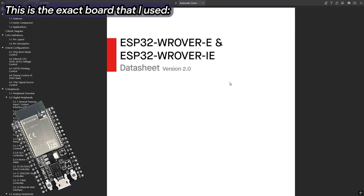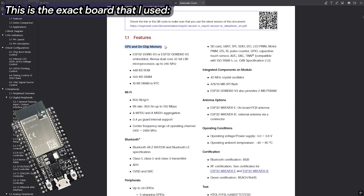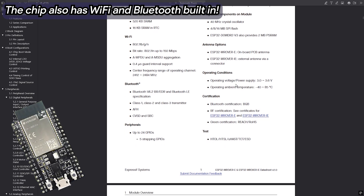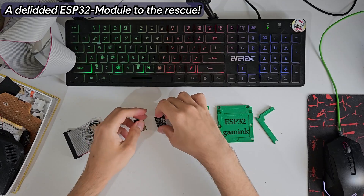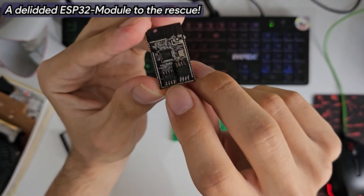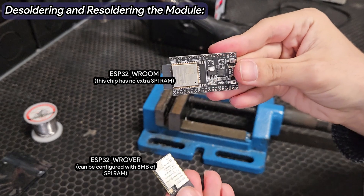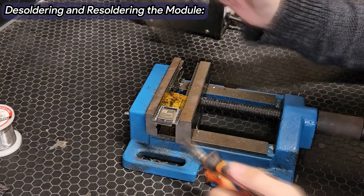Let's start with the electronics. The main brains of the handheld is the ESP32, a dual-core microprocessor running at 240 MHz. This high clock speed allows a fast connection to the LCD, enabling it to draw more than 30 frames per second — far beyond what a standard Arduino Uno can do. The board also has an external 8 MB of RAM, which allows emulators to hold the game ROM in RAM for extra performance. Since I couldn't find a board with the extra RAM chip, I bought a standard development board and a RAM module separately, and fused them together.